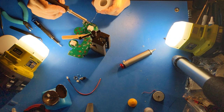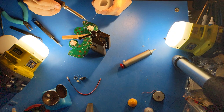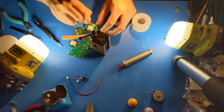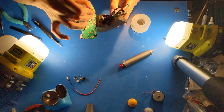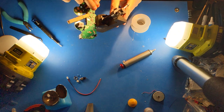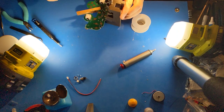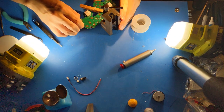One thing I forgot to mention is that you always want to flash the firmware onto the motherboard before you begin all of this in order to make sure that it's functioning and you don't do all this work on a dead motherboard. Usually what happens when a motherboard is dead is the very, very fine soldering around the pins on the microcontroller can be bridged. If you are looking at the microcontroller, the one in the center and the top on the left side, those ones sometimes bridge anyway, but those are internally connected, so it doesn't matter. But you definitely want to make sure that none of the others are connected.